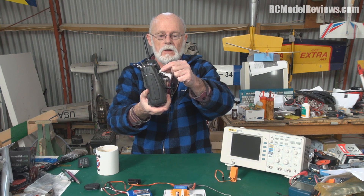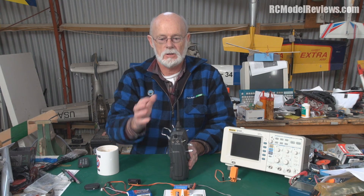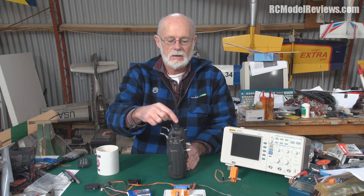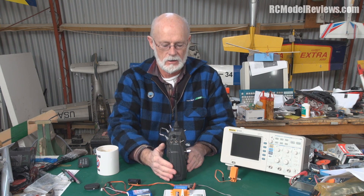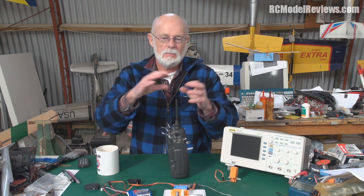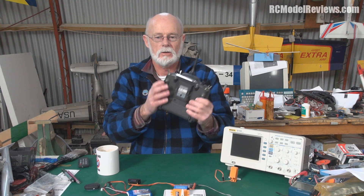When the stick is up, the voltage might be 2 volts; when it's down, it might be 1 volt. By measuring the voltage the microcontroller knows where the stick is. If you've got 2.4 built in, it turns that voltage straight into a number — the position of the stick — and sends it out the antenna, really quickly. In an old radio with a module or DIY kit, the radio turns that voltage into a pulse of variable length: centre is 1.5 milliseconds, one extreme is 2 milliseconds, the other is 1 millisecond. The DIY kit then takes that pulse and turns it back into a number — that's the extra step. Because the pulse is a finite length and there are a finite number of them, you add up the lengths of those pulses times the number of them and you get a big delay. That's where the extra latency comes in.